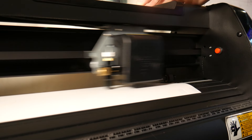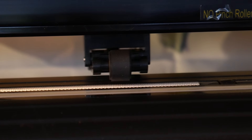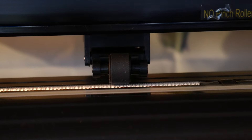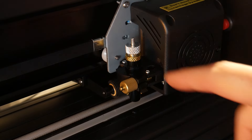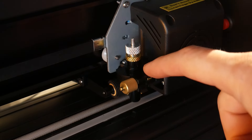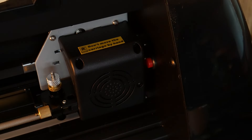Plotters like these have three axes. The X, which is belt driven from left to right. The Y is achieved by pinch rollers and a knurled rod that feeds the vinyl forward and back. And the Z is usually a solenoid in the cutter head that can apply pressure at a specific force, plunging the knife into the vinyl. The unit has an end stop button for the X axis to zero it in on the right-hand side of the machine.